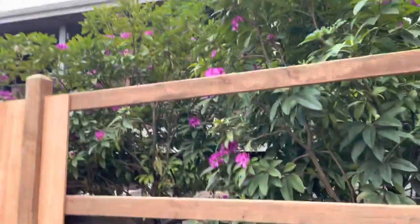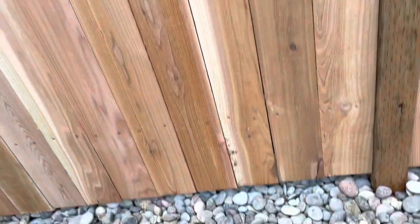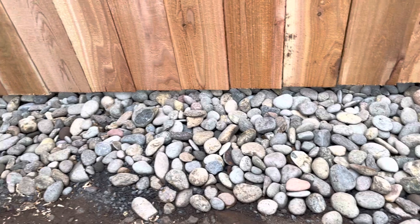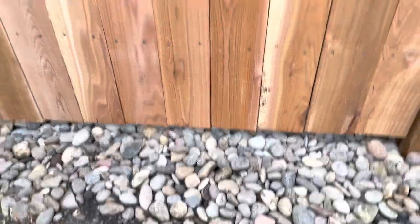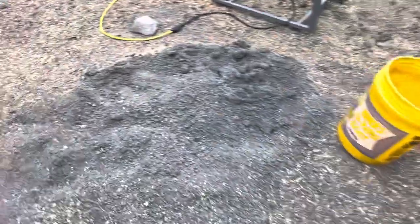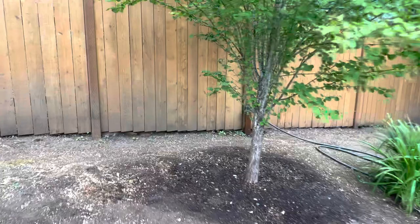That's pretty much how I build it. New this year: I'm cleaning out the soil under the fence and running in some 1½-inch round river rock along the fence line. First I lay in a little quarter-inch minus, then the river rock on top. When it rains, the rain will hit the river rock and won't splash mud up onto the fence — I've had a problem with that. I'm going to run it all the way down the fence. See how muddy and gross that looks? I'll wash that off and then run some rock. That's the fence project.